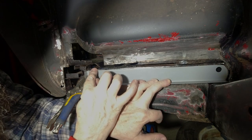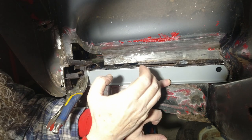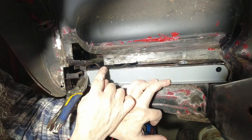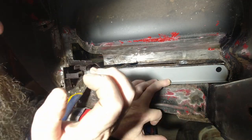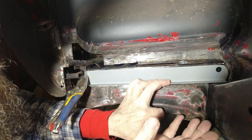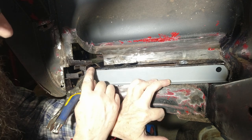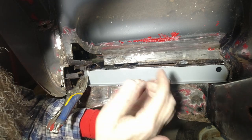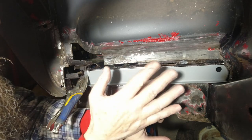What I'm going to do here is put a spot here, a spot here, a spot here — every inch or so — and give it a cool, then move along. I'll put a spot here, one here, one in the middle — three spots, roughly six inches away from each other. Heat distortion slows you up towards the end of your game and can sometimes destroy your whole piece. Heat is critical, so stay the furthest away you can. I'll show you how to get it down, polish it, and finish it, because remember there's a skin coming.